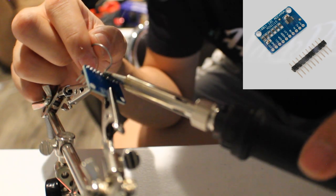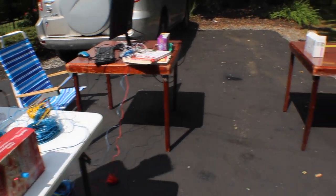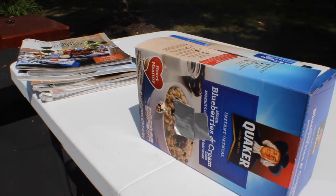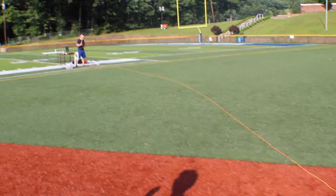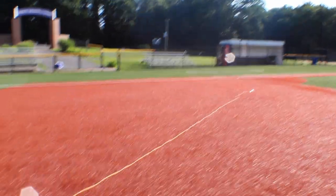To fix the issue involving the cups allowing too much light to pass through, we replaced those with some thick cardboard boxes. Oh, and we reprogrammed our stopwatch to actually measure time accurately by constantly calculating the difference between the current time and the time at which the stopwatch was activated. After we applied these changes, we decided to head back out to the field and give it another go. We were definitely pleased with the results this time.